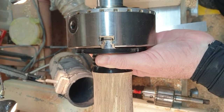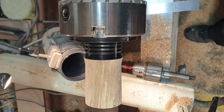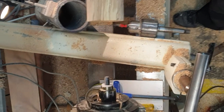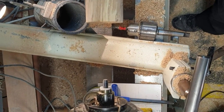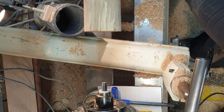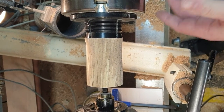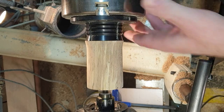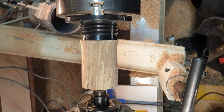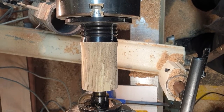I'm doing all the camera work by myself, so trying to explain it as best I can. Push the tailstock forward and just before it touches, lock it in. Wind in the quill until it touches — I'm winding both sides, one wheel on the headstock and one on the tailstock.